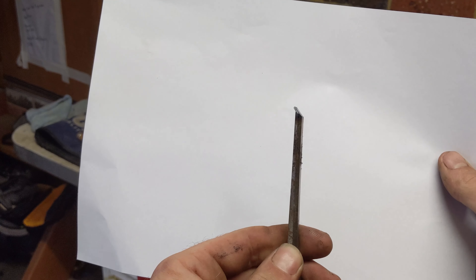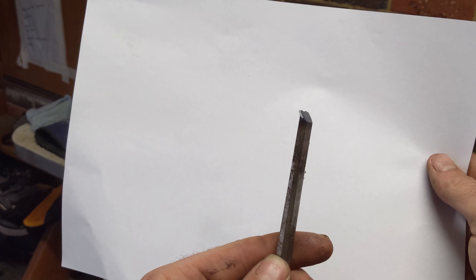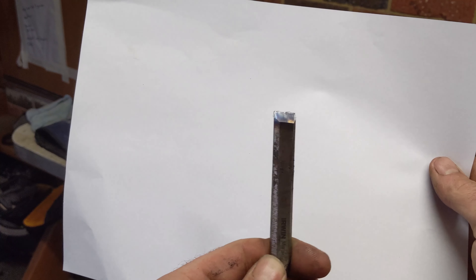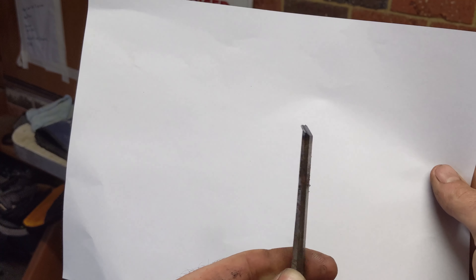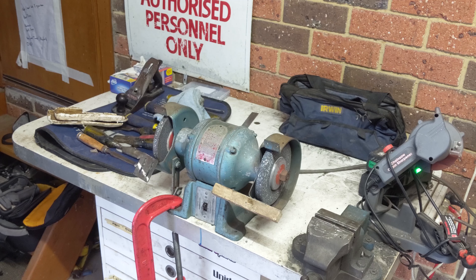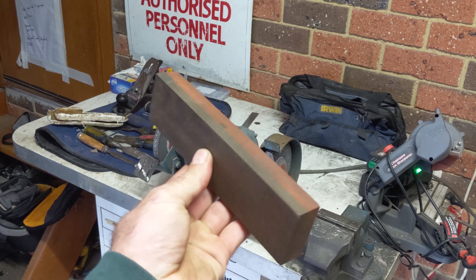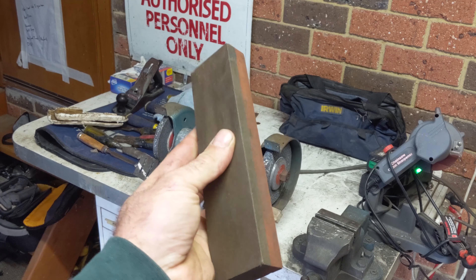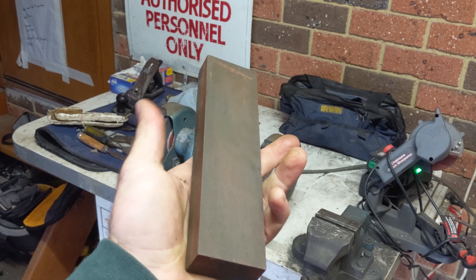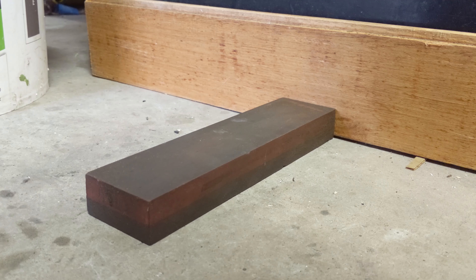Now that's ground back. We've got to get the grindstone out to get rid of all this debris on the tip — it's kind of burred over at the end. This is my grindstone; there's a coarse side and a finer side. We've done all the hard work with the grind wheel, so we'll just be using the fine side of the block.